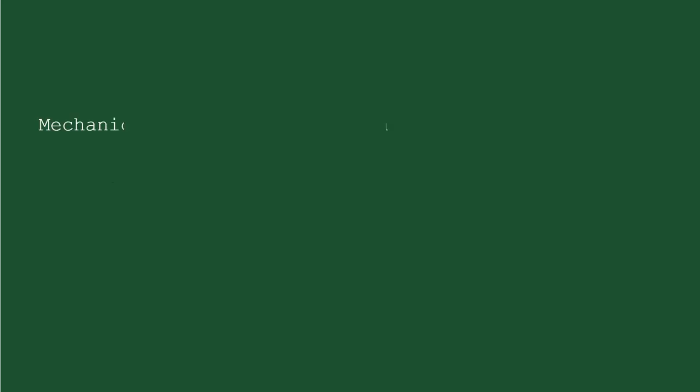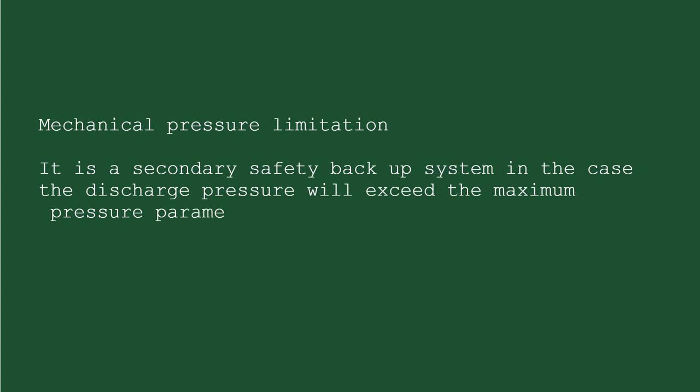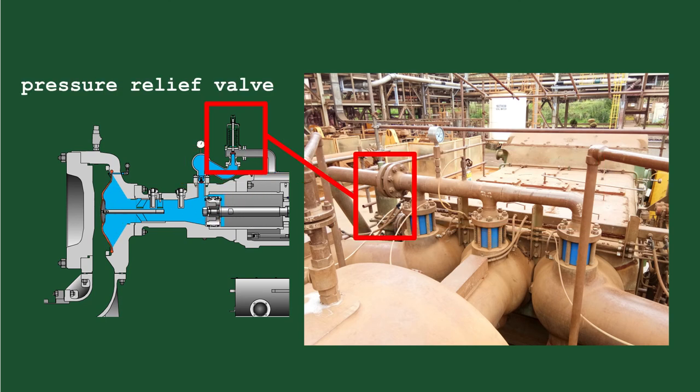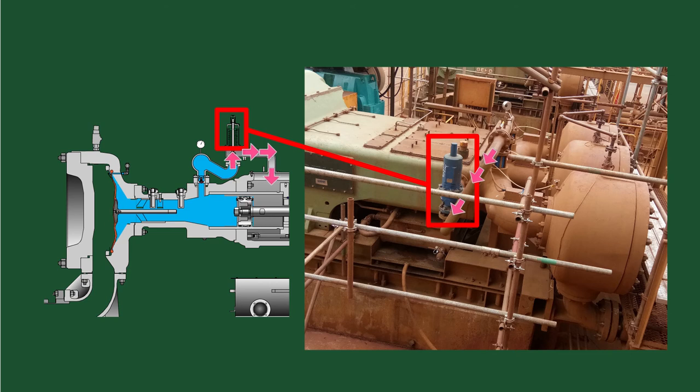The mechanical pressure limitation is a secondary safety backup system for when the discharge pressure exceeds the maximum pressure parameters. A one-way valve is situated between the diaphragm housings, and a high-pressure manifold connects all of the propelling liquid chambers to a pressure relief valve (PRV). The highest normal pulsations in the propelling liquid system are read via a pressure gauge connected to it, and when pressure exceeds the set maximum value, the PRV releases the pressurized liquid back to the tank.